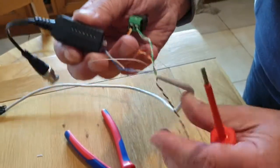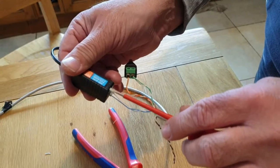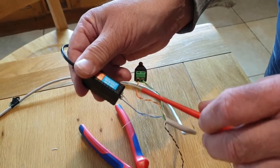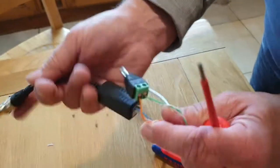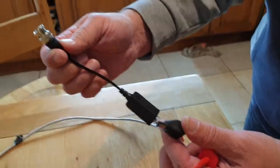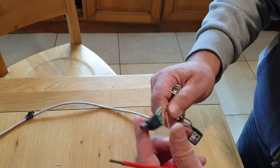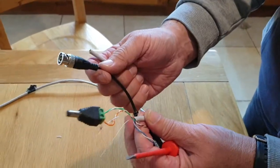You can disregard the brown wire — we don't need that. Solid blue for the video positive and blue-white for the video negative on the balun. Some of these have a screw rather than a push-in terminal. This end goes into the camera for video, the DC plug goes into the power on the camera, and the female DC connector plugs into the power supply. That's it — all done.